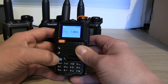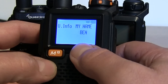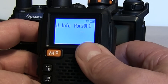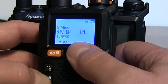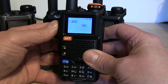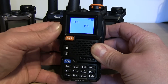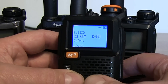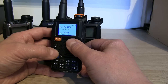You can put all your information in for SSTV — name, callsign, grid reference, GPS latitude and longitude, and who you're calling. It does APRS as well, so you can send your position. It'll also do CW — you can plug in a Morse key and send CW on the two-metre band directly from the radio. It'll apparently also do two-metre SSB.